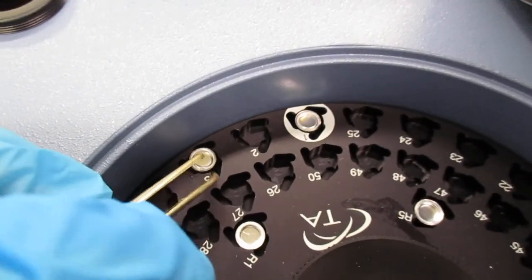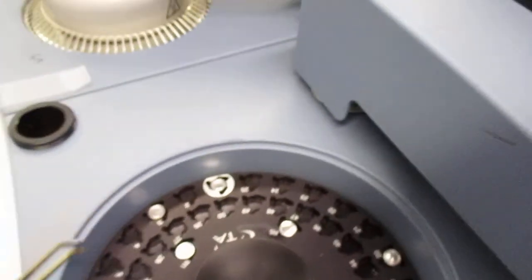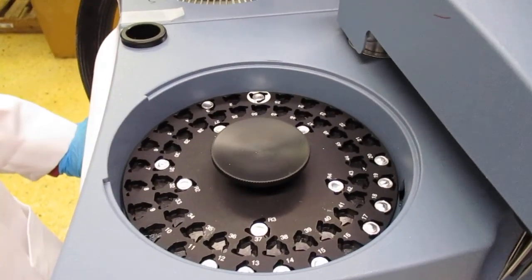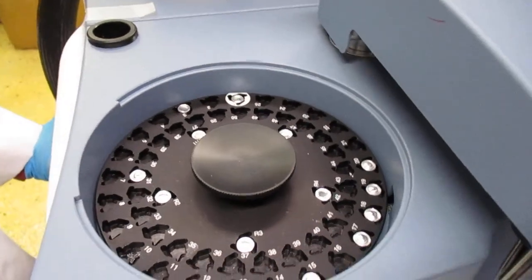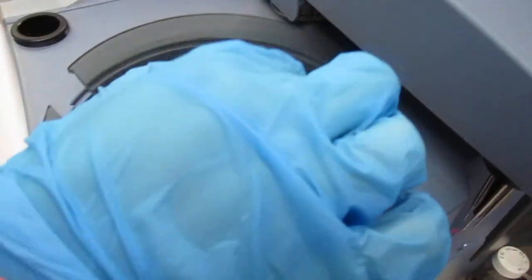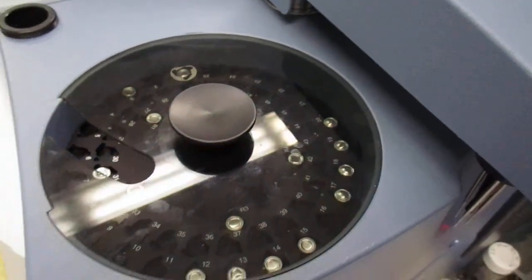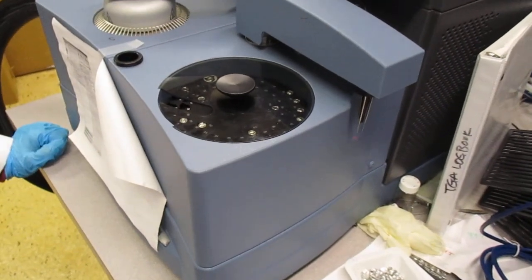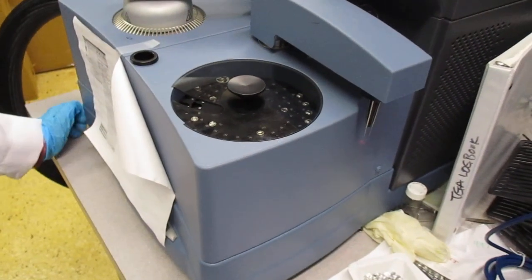And you're going to want to keep in mind all of these numbers that correspond to all of your samples. Write them down in your notebook, as you'll need to put those into the software later on. So once you have all your samples labeled and put in here accordingly, you can go ahead and put the lid back on. Now your samples are loaded, and we can move on to the next video where we will talk about how to get the data collection and run the software.